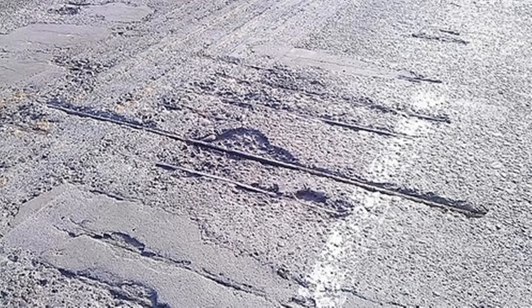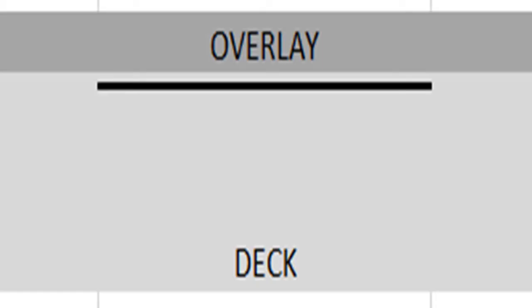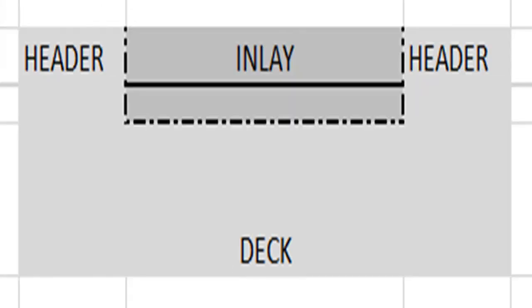For decks where the reinforcing steel is what we refer to as high or having very little top cover, the overlay works to add cover to the bars. This may also require a load rating analysis to take into account the added dead load on the structure. Inlays obviously have the advantage of allowing for expansion joints and approaches to be reused in place, expediting work.